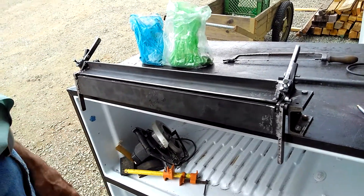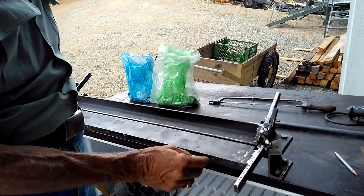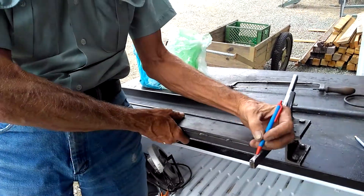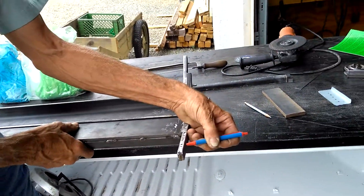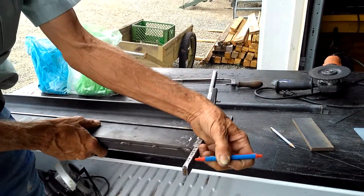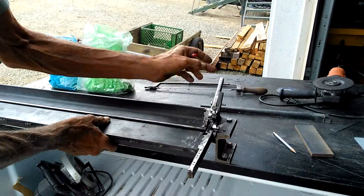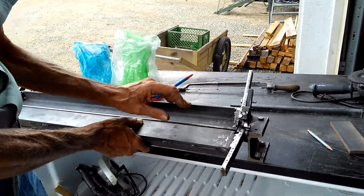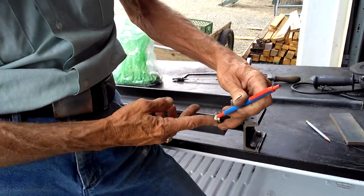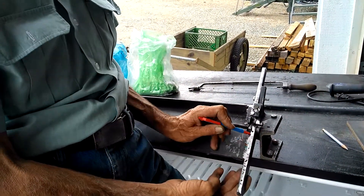There are some kinks I'll tell you about right now. Your bending leaf handles, which attach to your bending leaf — which is three inches wide, quarter inch thick — will need to be three-eighths wide by three-quarter inch flat. That's a size of steel they don't normally carry at your steel company. Also the six-inch long bending leaf clamp handles are also three-eighths. So we took two three-sixteenths thick by three-quarter flat pieces and welded them together to make this happen, as you can see right here.